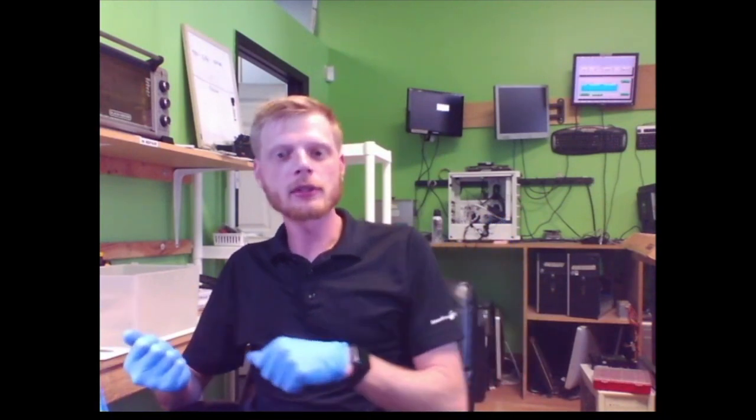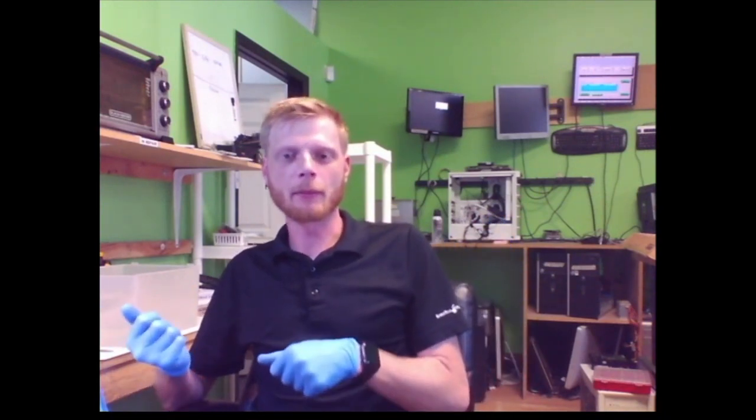Thinking about it, I think it's perfect that the Apple logo showed up, because that's kind of what I was saying with the battery going into protection mode. You saw as soon as I took it out of the water, the phone stopped working. That was the battery or something shorting on the board, and the battery going into protection mode. And as soon as I plugged it in and it tried to take the battery out of protection mode, it did. It started to boot, didn't even get all the way to iOS, and just shut off from there.